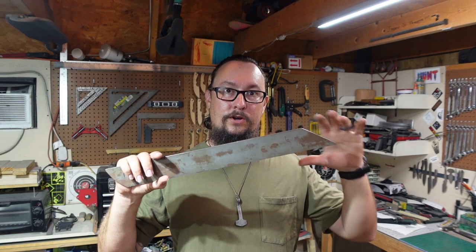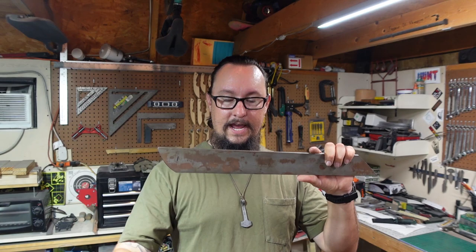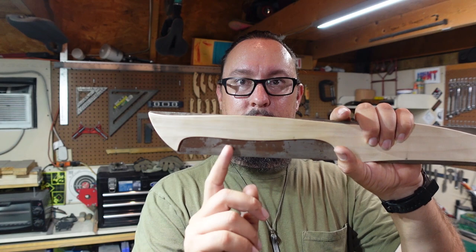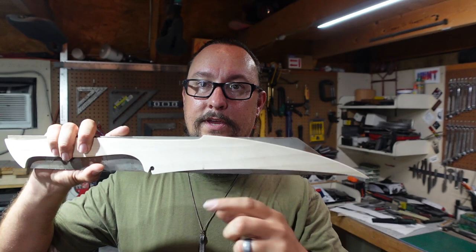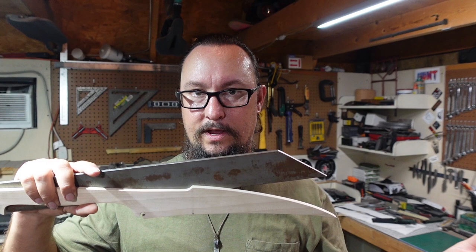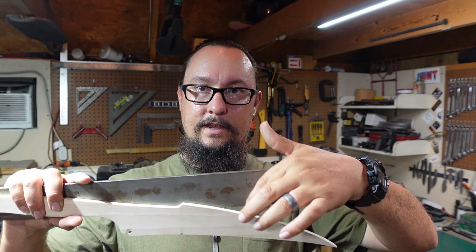So in the next video, what I plan on doing is trying to get the handle shaped, because whenever we get our handle forged out, we can actually start seeing what material we have left to do the blade part. So let's say I get the handle forged out in that little area back here. We start forging in this little area here and push this out, start pushing forward. If we only use this much to make this whole entire handle, then I might be able to cut off a whole section here, because this whole entire section, I can make a whole other knife with that, forging it. It's 3/16 thick. This is thick material.